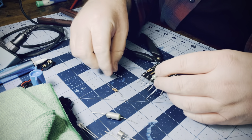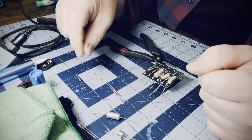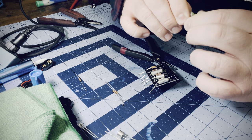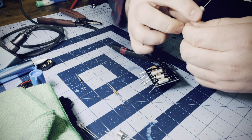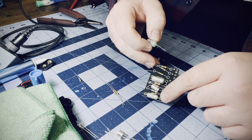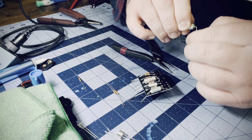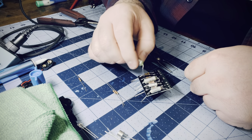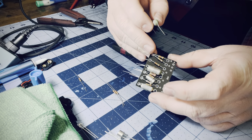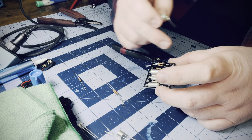We've got a couple other resistors here that go on the board in a different place — this one goes under the board. First I've got to do this bigger cap that goes on the output here. This is the output cap. Pretty much anywhere you see a capacitor in this circuit, it's coupling different stages. What the caps are doing is they're blocking DC voltages from going from one stage to the next so that the bias can remain consistent in each stage, and so voltage doesn't leak in or out of the circuit.